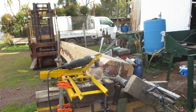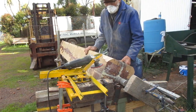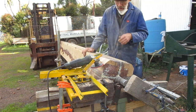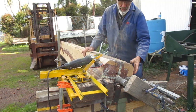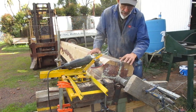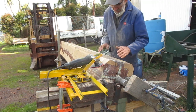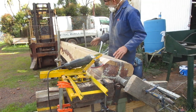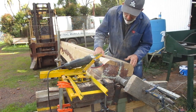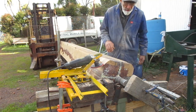This is the axle tree for the new build water mill on Sipmilk's Flay, and the end has to be rounded off so that we can put shrink steel bands onto it to hold the four-bladed gudgeon firmly into the wood. This is the end that will have the water wheel on it; the other end will have the pit wheel on the inside of the building, and I've been scheming how I'm going to do this for about a year now.